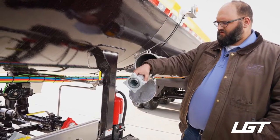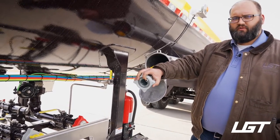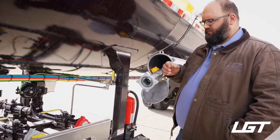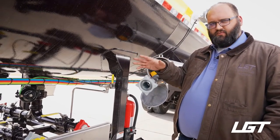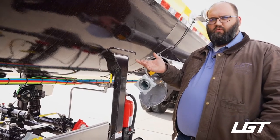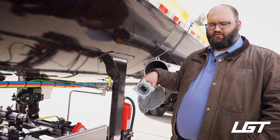In this case, what you have in here, and we'll get a close-up of it here in a second, is a flap tied to a steel braided cord that runs the length of the hose, and it's protected from the chemicals that you'll be hauling, but over time they will wear out, which is why every year these need to be certified along with your annual VK inspection.